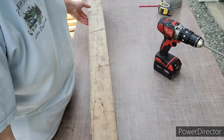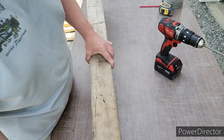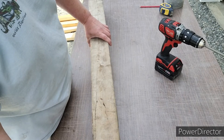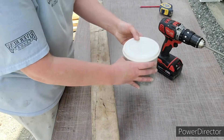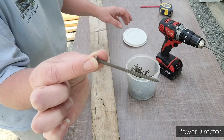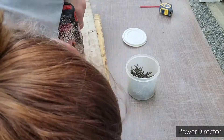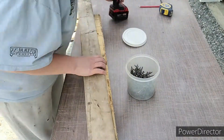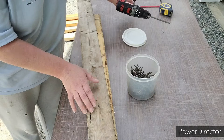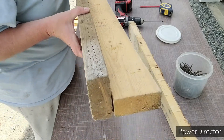So what we're starting out with here are some 2x4s that I cut down to 48 inches. I've got one laying on its side and the other one I'm going to lay on top. The other little 2x4 in there is just to help lay this one on top so it doesn't fall over. Now I'm going to use some wood screws — I believe they're about 3 inches or 3 and a half inches — and my drill, and we're going to attach the two pieces together. I make 3 of these and this is what it should look like.